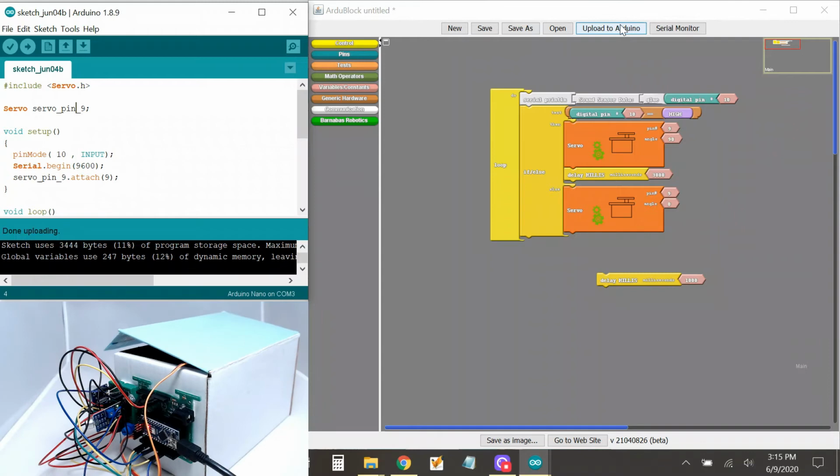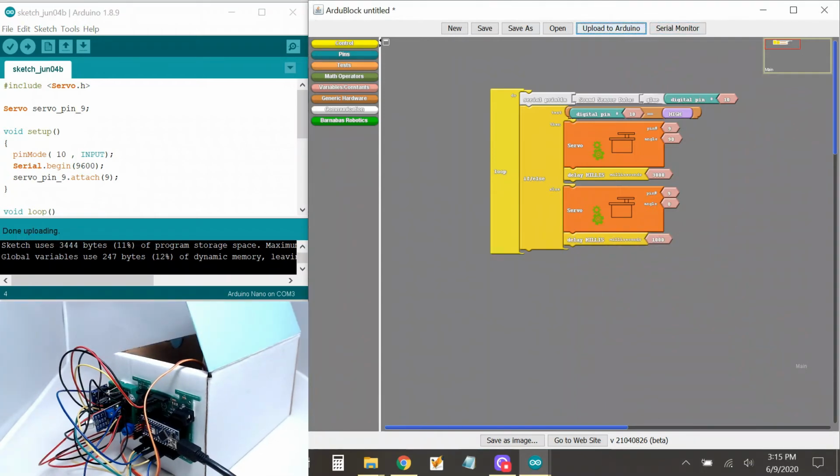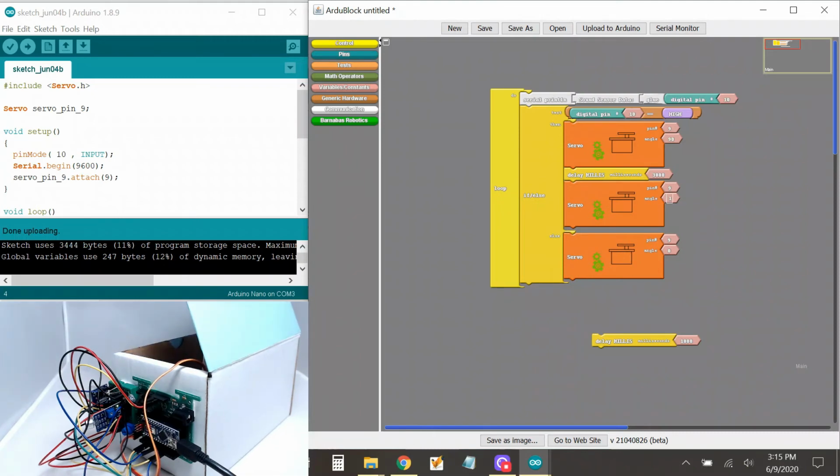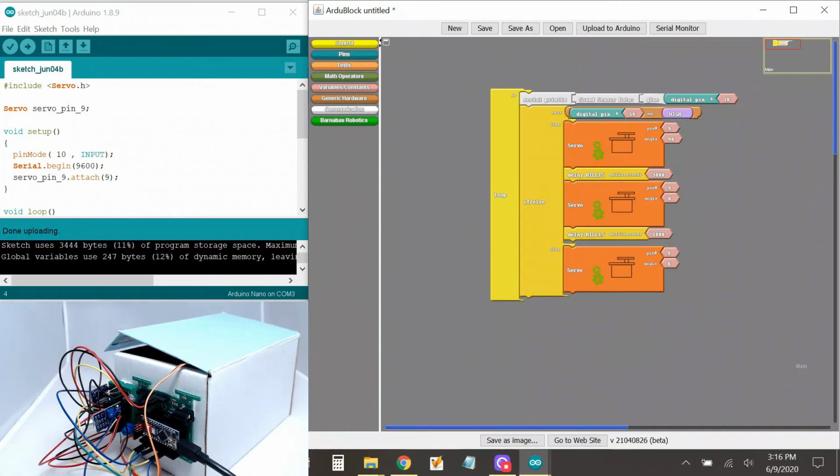Okay, I got an idea. Before we would put this delay here, that's actually not where we want it. We want the delay up here. So why don't we do this? We're going to open. So if we hear a sound, we're going to open, and we're going to keep it open for 3,000. Then right after, I'm going to close by doing a zero angle. And then I'm going to wait 1 second and then keep going.